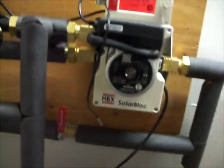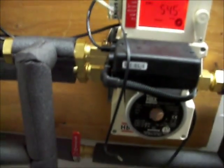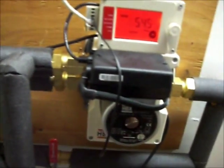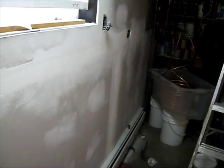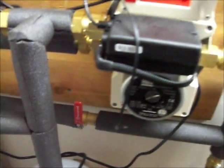Here's the pump setup. It's a Solar Block HBX. We just have the tank temperature sensor right here because we don't have the tank hooked up yet. The tank is going in the far corner where you can see the copper loop. Here are our baseboard radiators - that's our dump load. They're turned on right now because it's wintertime. In summer we have another dump load outside, which is more radiators that we turn on.